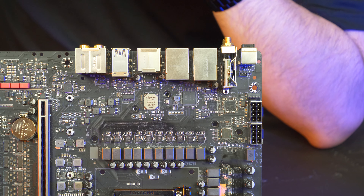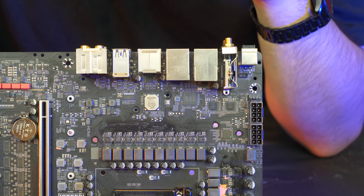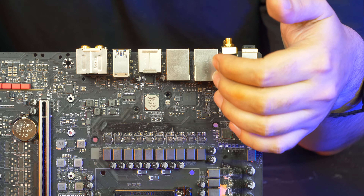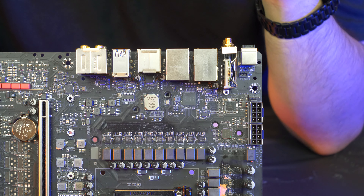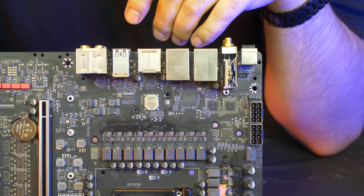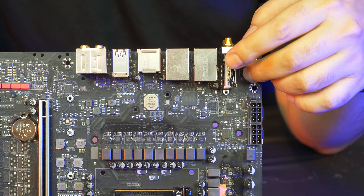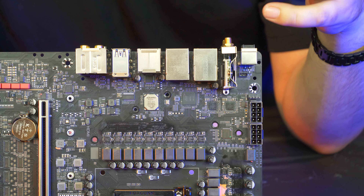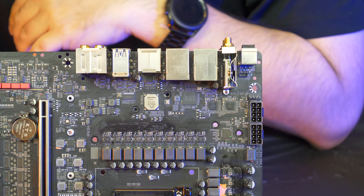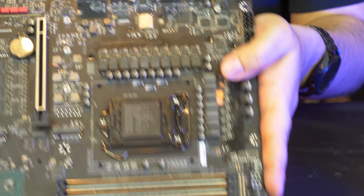There's a wireless AX201 controller for Wi-Fi. For the NICs, there's an AQC107 from Aquantia — a 10-gigabit NBaseT NIC that supports 10G, 5G, 2.5G, and 1G speeds. In enterprise you can get 40 gigabit, but mostly over fiber, which most people don't have running inside their homes. There are also two Type-C controllers and a level shifter for USB on the back, since the CPU outputs DisplayPort natively and a converter chip changes it to HDMI.